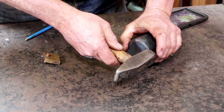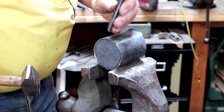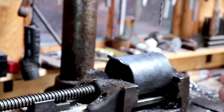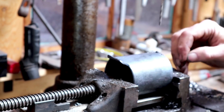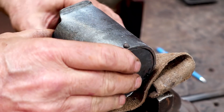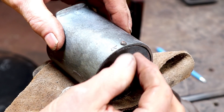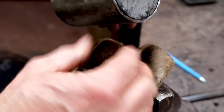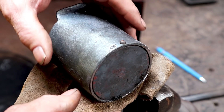I'm just going to start with a single hole and rivet at first just to hold everything in place. I'm going to have about a sixteenth of an inch gap between the rivet head and the piece when this is all done - just like that, so that rivet doesn't sit down tight. I'm just going to put a little piece of leather over the top of the vise so this kind of holds things without gouging it. I'm going to do a little hand set rivet there - now that doesn't want to come back out. That rivet has to expand somewhere, and when it hits the bottom of the hole it expands to fill the sides and makes a nice tight fit. By the time I've put eight rivets around this, that bottom isn't going to want to fall out.